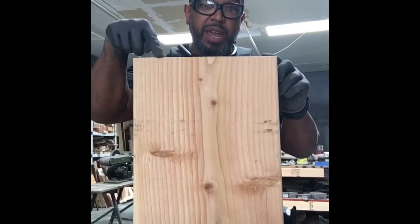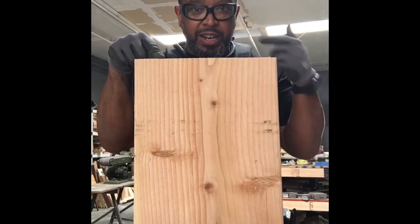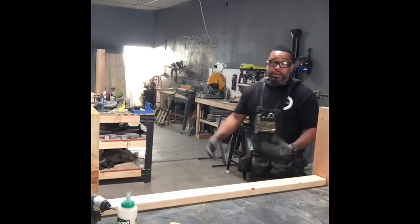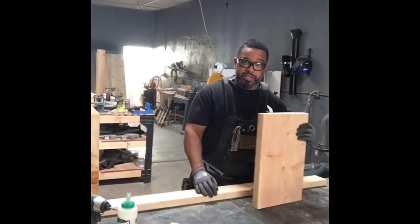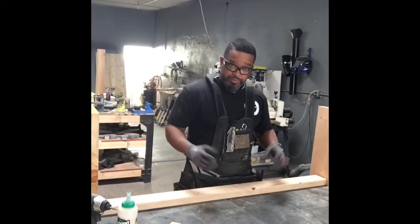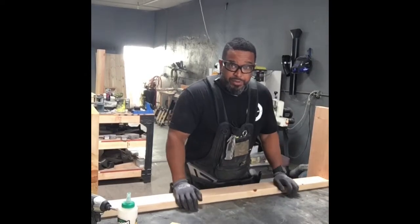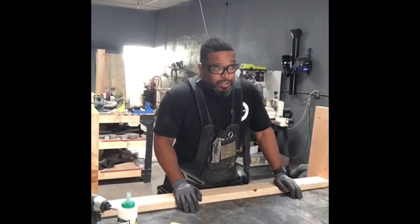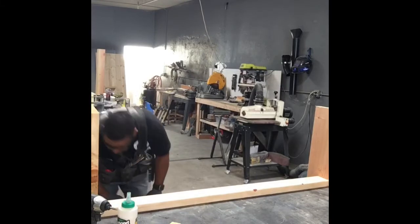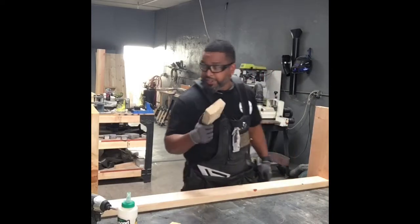When you have your 2x12 — in this case I have a 5-foot bench and an 8-foot piece of wood, which left me with 3 feet — I cut that in half and got two 18-inch pieces of 2x12 to make the legs. You've got your 18-inch piece and your other 18-inch piece, and your 4-foot 2x4 to go in the middle as a stringer between the bench so that you don't get any side-to-side movement.